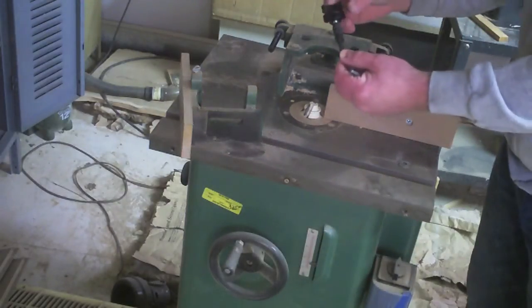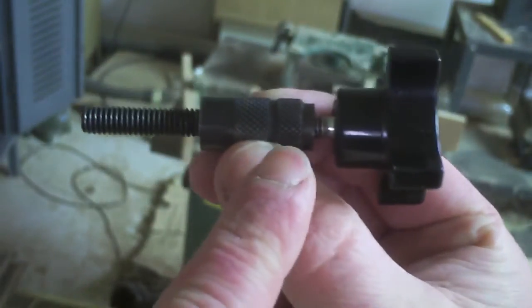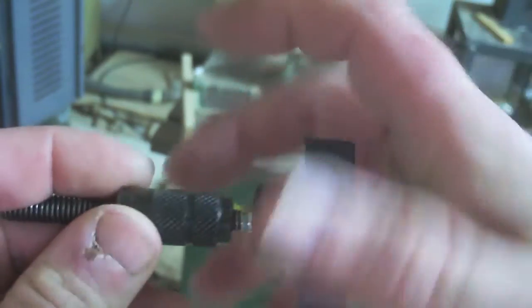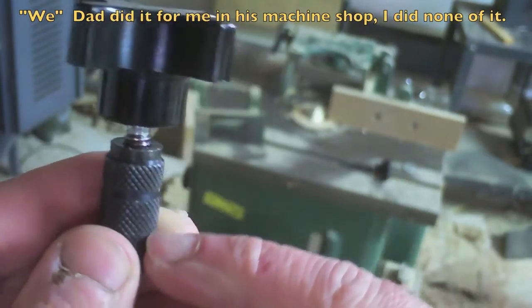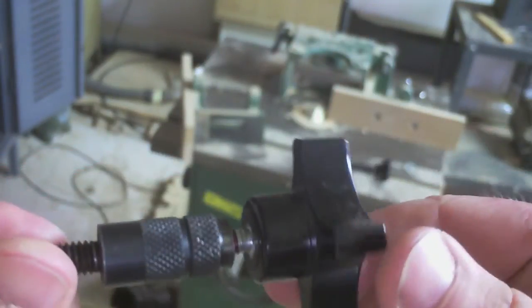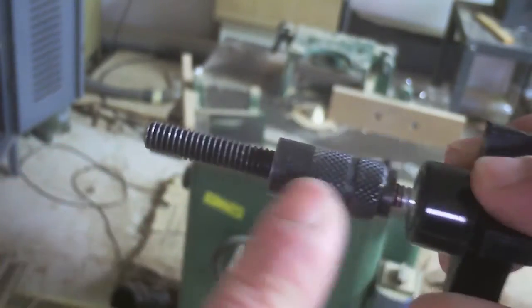So we solved them by making some of these. The post is the standard Grizzly attachment post, and this is the portion that started to crack and flake off so that you could no longer get any leverage. What we did is we drilled a hole into the center of it, tapped it, and then screwed in some generic knobs using red Loctite. Basically, without a whole lot of heat, you'll never get this back apart again.